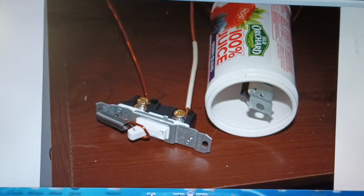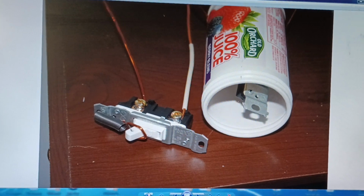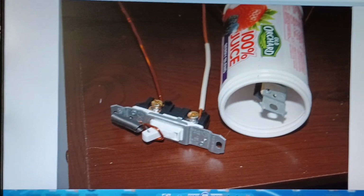So, far better than traps. Traps might be parallel or series resonant for one band, but in the other band they're a residual reactance, and that screws up the antenna matching.